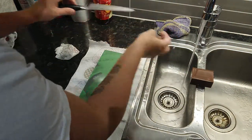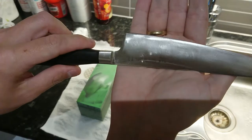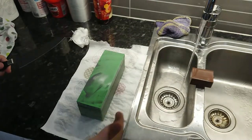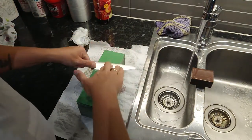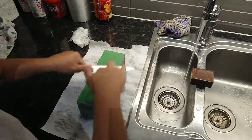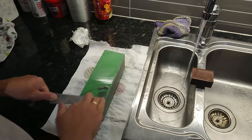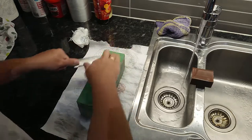Actually starting to get a little bit better. You see, it's starting to help. I'm gonna thin it like crazy. I'm now gonna tilt it a little more up, also, just say from 2 to 3 degrees to around 5 or 6. This is to make it bend towards the edge, making it more convex. And then after, I'm gonna blend it all together.